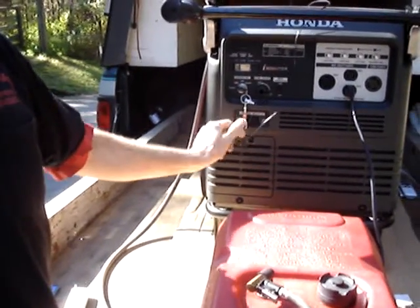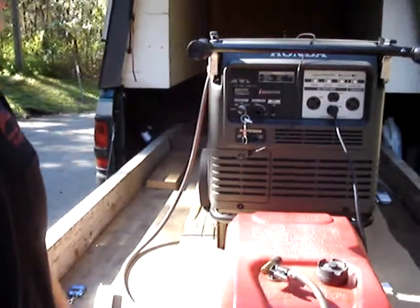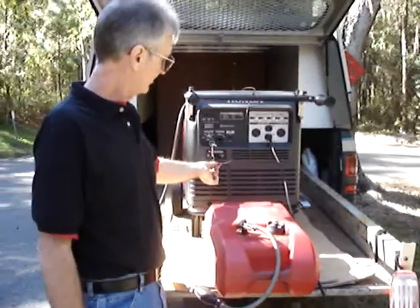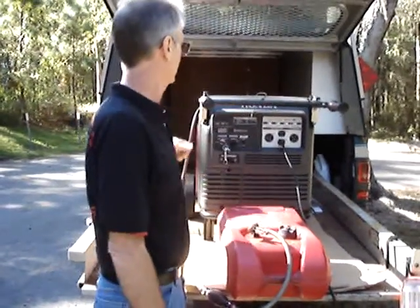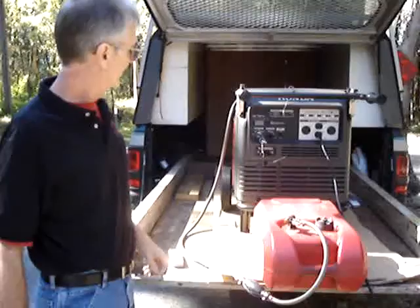I'm just running the antenna wire out through that, sticking it to the top of the fuel tank. I'll cover that in a lot greater detail in the installation instructions and show you the different options, the way that you can route them. But just make certain that under no circumstances do you cut this wire and try to resolder it together. And of course, put the antenna on something magnetic on the outside.